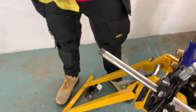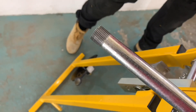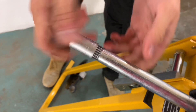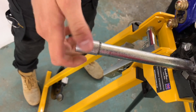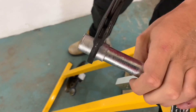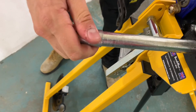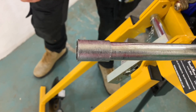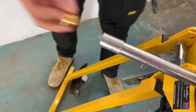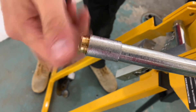So you can use your cloth just to remove the excess cutting compound. We're going to put a coupler on this one first, then we'll do the spouted box afterwards. I'll just tighten that up with some grips. There we go — no need to over tighten, that's nice and tight. The thinking is then that would probably go into a metal clad socket or switch and be connected via a male bush, sandwiching that between the socket box and the bush. We'll show how they're tightened up in a different video.